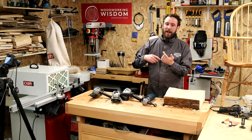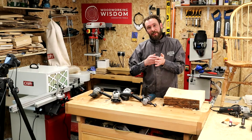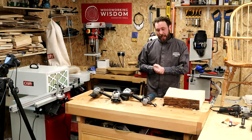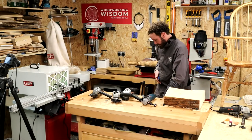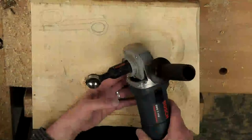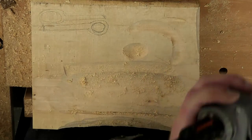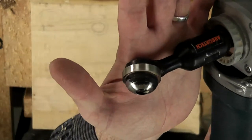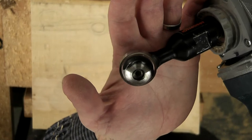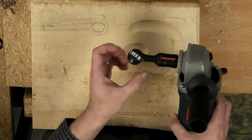As the cutting edge comes in, the back edge is being kind of polished as it goes. I'm not quite convinced on the science of that, but again, let me take that one out. I'll take the plug out and come on to camera three. Just like those smaller tungsten teeth we had on the industrial carver, this ball gouge has a little hex bolt in there. You take that off. This top bit comes off, and then that ring is replaceable or rotatable.